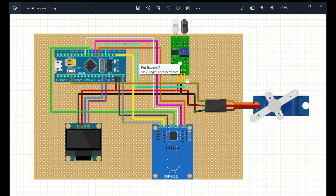The IR sensor consists of 3 pins: Output, GROUND, and VCC. The Output pin is connected to port A1 of the STM32, GROUND is connected to the GROUND of the STM32, and VCC is connected to the 5V pin of the STM32.